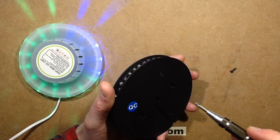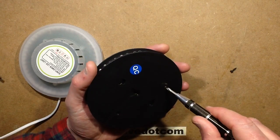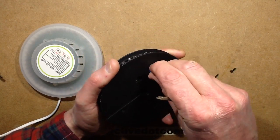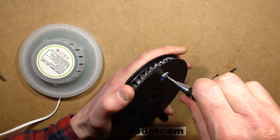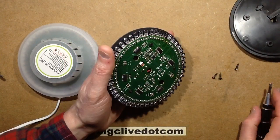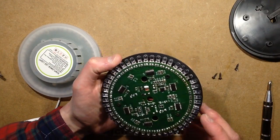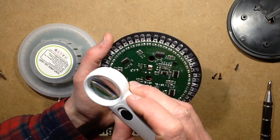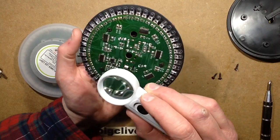I'm going to open the low voltage one up. I'm guessing from the positioning of the screws there's going to be another screw under this quality control label. I'll unplug that one at the moment just so it doesn't detract. So I'm guessing a microcontroller with serial chips — serial to parallel converter chips — just to actually allow maybe a big shift register to run all the LEDs. That would be the logical way to do it. Before I even look at these chips, I'm going to make a wild guess that it's the 4094 — I might be wrong. The 4094 is a CMOS shift register. Oh, is that the microcontroller there? That's just a wee 8-pin microcontroller, because it is just putting serial data out. Let me get a magnifying glass. Oh no, I'm wrong — damn.